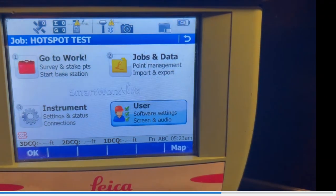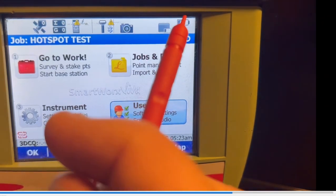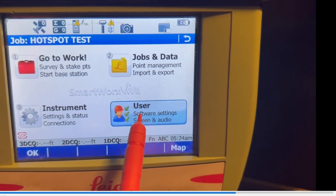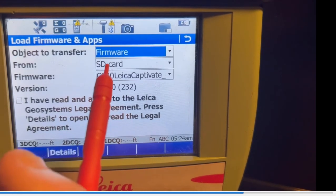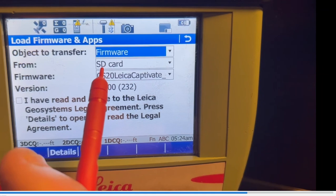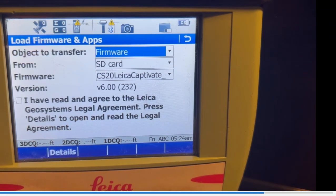Now, if you're going to upload firmware — this unit has firmware version 8 — we recommend a very current firmware version. Make sure you've got a fully charged battery, then hit User Tools > Load Firmware, with the firmware file on the SD card. Click the button and hit OK. It'll take around 25 minutes to load the firmware.